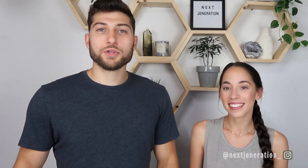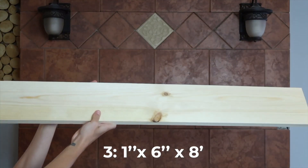For some reason our fireplace is just a flat wall — there's no mantle, no shelf, just useless lights. We're going to replace the lights with a mantle by building a box beam. For this build you'll need two two-by-four-by-eights and three one-by-six-by-eights, though this will depend on the size of your fireplace.